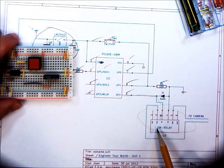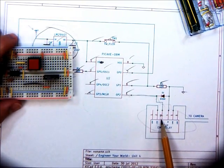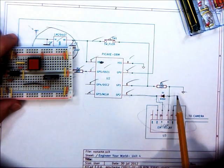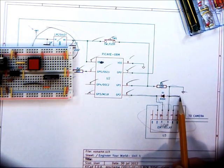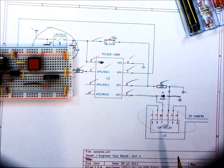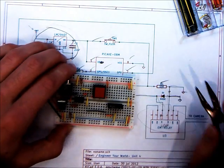Current is going to come from pin 5 through pin 3. There's a little electromagnetic coil in the middle of the relay, and current goes through that coil to ground. Even though the schematic shows it connecting through a symbol to ground, it's just shorthand — it's the same as connecting to ground directly. Let's go ahead and do that — there's pin 4, and we'll give it a connection to the ground bus.